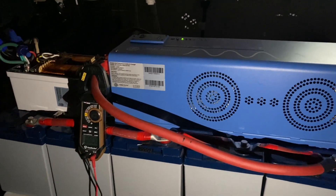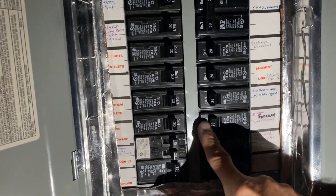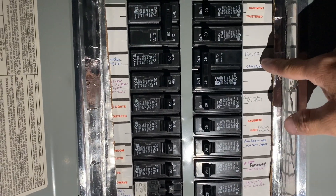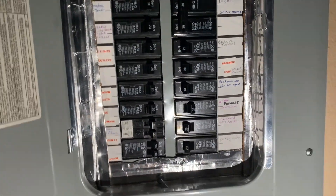I actually turned it on to power saver mode — don't want to do that. Let's go ahead and turn off the HVAC because I don't want to try to run that. Although it will run, I'm not interested in killing the battery bank that quickly. That's the dryer, that's where the power is going to be coming in, and here's our HVAC right here. That's the furnace, so we can turn that off — it's hot out so we don't need it. So those are the only loads I don't want to run. We'll go ahead and turn this on.